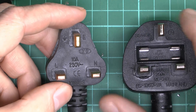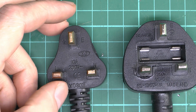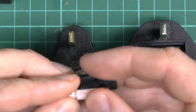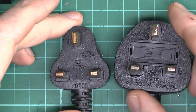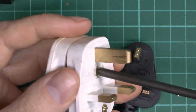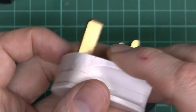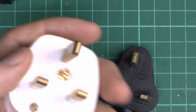Now the biggest omission from this thing is that there is no fuse in it. This is where the fuse holder would go in a normal plug. What's supposed to go in there is a fuse of this sort of dimension — this happens to be a 13 amp one — and it comes with a little plastic piece that presses into the front. If it's a plug you can wire yourself, those also have a fuse inside. All BS 1363 plugs do have a fuse in them somewhere, and that's actually part of the standard.